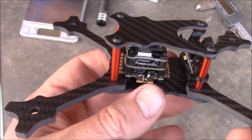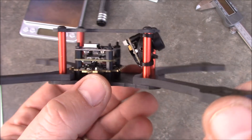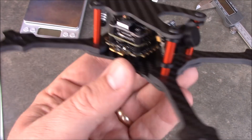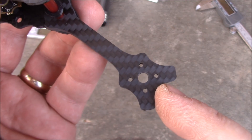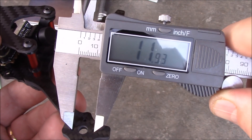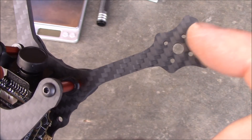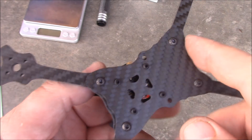This thing is incredible — it's almost all put together and I haven't done much real work to put it together. It's a 40 amp 4-in-1 ESC so any motors of this size should spin just fine. It's designed for a 1407 or 1506, which use about 12mm hole spacing. Make sure when you're picking out motors that you get the 12mm size and that they use M2 screws. If you're using M3 screws you'd have to drill out the holes, which messes with the frame's integrity.